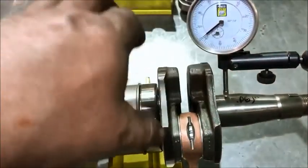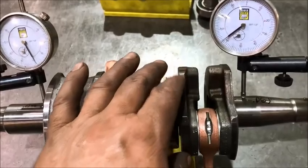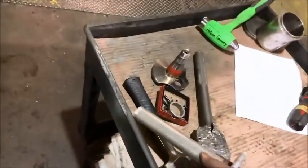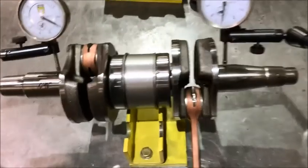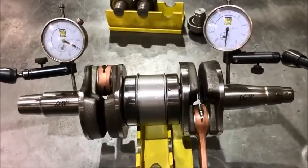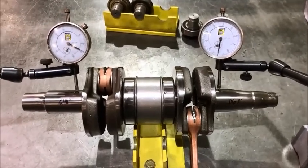So I know I've got to bang it this way. I've got to figure out a way to hold the center section without disturbing it, and then with a lead hammer or I've got an aluminum chisel — you want a metal that's softer than the forged steel. I already put a dent in it trying to tweak it when I got another section together, and there's the dent right there. So I'll just have to file that. Let's bang her out, and then once that's straight, we'll get the bearings on and we'll be ready to assemble. But this is going to be the most tedious part — dialing in now with lots of hammering.